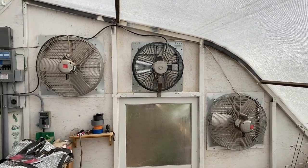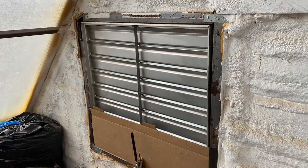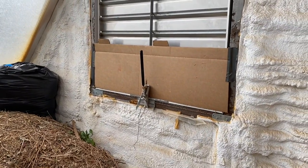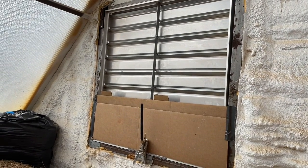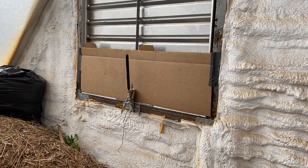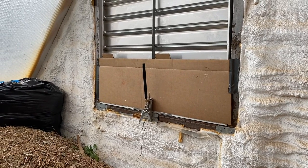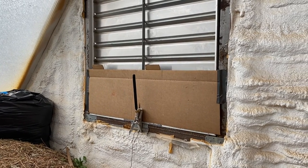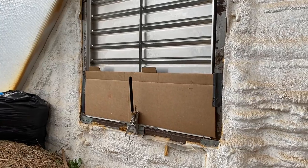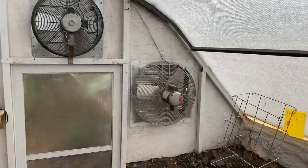The other change we make here in the suction room is I put the solar stick onto this vent so that this vent remains closed when it's cold, but when it warms to mid-60s and above, this vent will slowly open up. The reason I put that cardboard cutout there is because when it's really cold outside and that vent opens up, it'll cool down that solar stick too much. So just by using that little cardboard cutout, it allows that solar stick to operate properly and open and close where I want it.